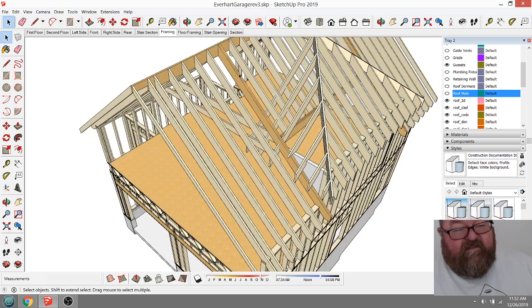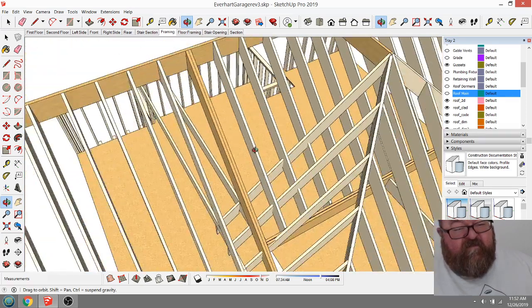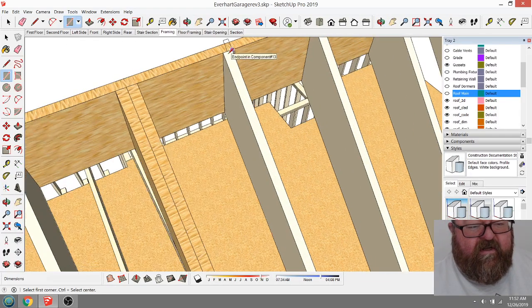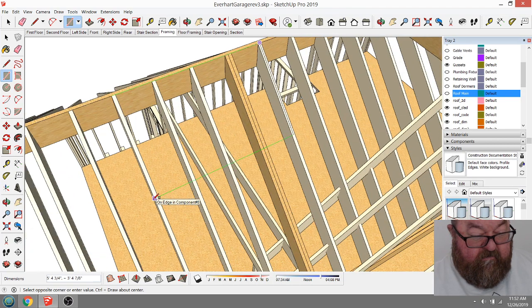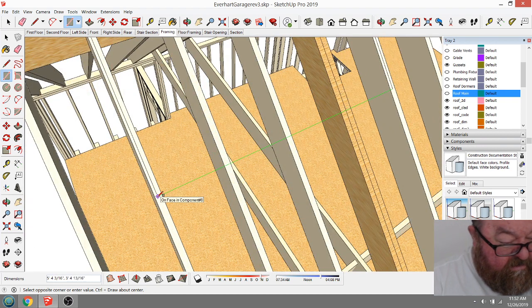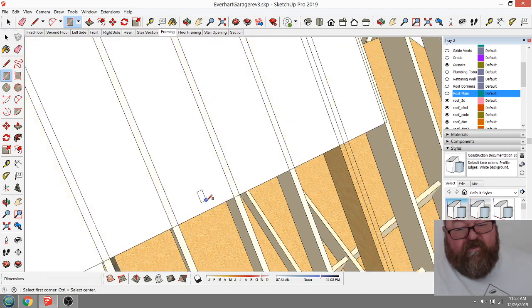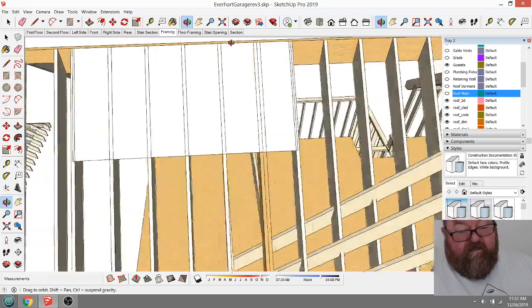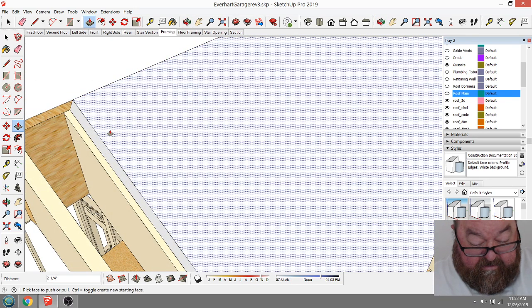What you would have is decking. You would deck this entire side of the roof first. So I could just deck the part around this roof. Probably wouldn't hurt anything. Let's see. Let's go 8 feet by 4 feet. That'll be our piece of OSB. And why did that not come out in the center? Oh, it did. And that would be 7/16 thick.